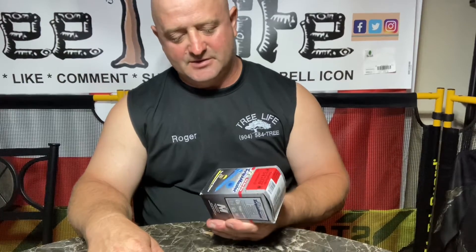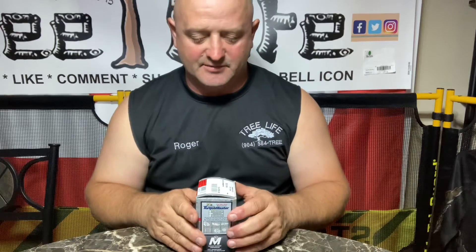Anyway, the other day Tony was moving stuff around the shop and we ended up breaking our water line. There was a little box out in the middle of the yard that had some electrical and a shutoff valve to the house. We didn't take the time to dig it down and make it level when we were pouring concrete, so we just boxed it in and concreted around it. Two or three years later I finally broke it, so we dug the hole and put all the electrical and plumbing underground. Now we have a shutoff and a plate of steel — not super thick but thick enough to walk on — packed full of rock and dirt, so when you step on it it's protecting the PVC and the shutoff.